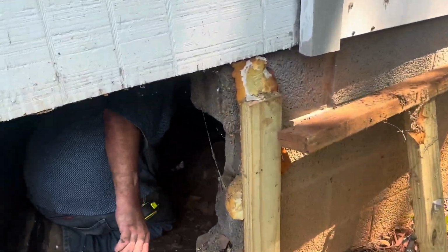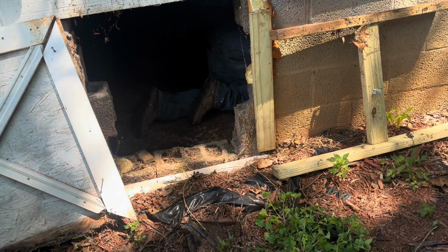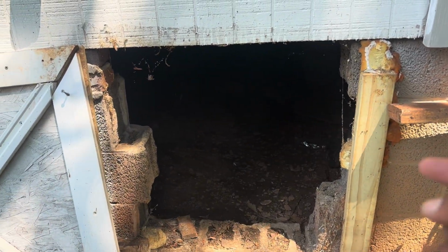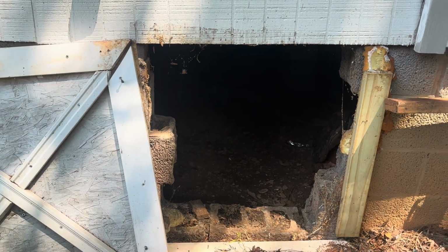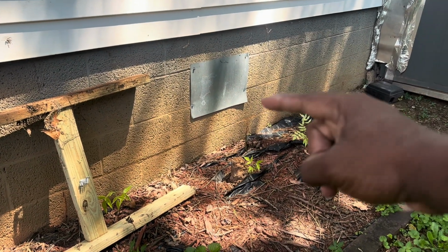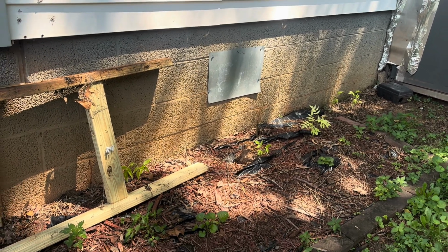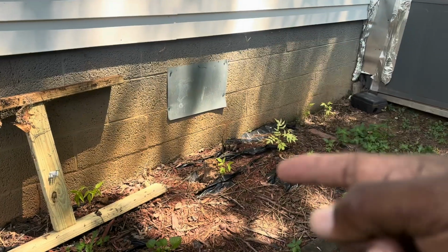I'm looking in the crawl space. So what happened was a couple of the pieces of the duct work had fallen down. Now I paid. People charge more money when you don't have the mil paper down, 6 mil or thicker, and I paid somebody to put it down, but it looks like they only put it coming from here. And the reason this is blocked off, there's vents, and there's other vents in the house that allow the crawl space to breathe. But what this was, the people that did the masonry, they had slits going through right here.